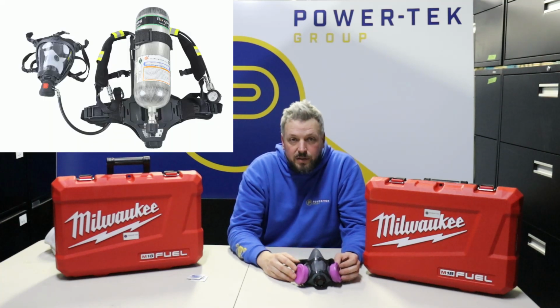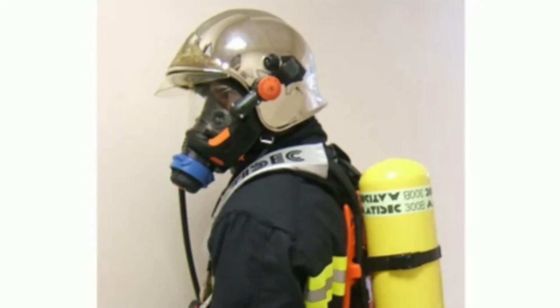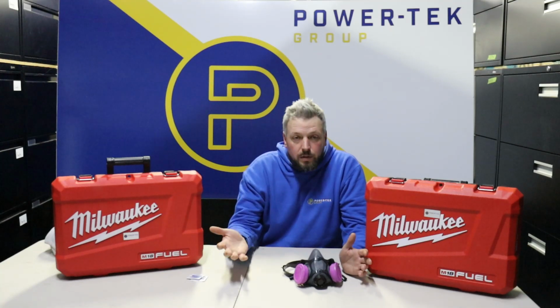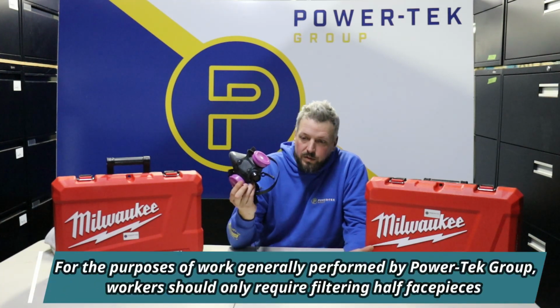On top of that, there is also an air supplied system referred to as an SCBA, self-contained breathing apparatus. This usually involves either an oxygen tank or some sort of hose that goes up into the mask itself to feed you with oxygen. Those are used for extremely hazardous locations like an H2S leak, or sometimes if you're down in a manhole and there isn't a proper oxygen supply. But again, commonly we're going to use these, and they're useful in all kinds of situations. Hammer drill, drywall dust, anything you can think of.